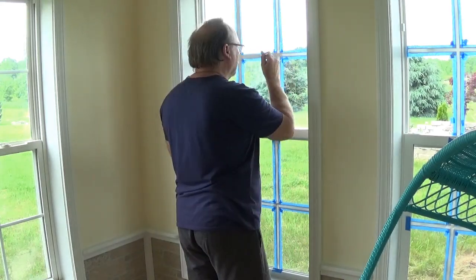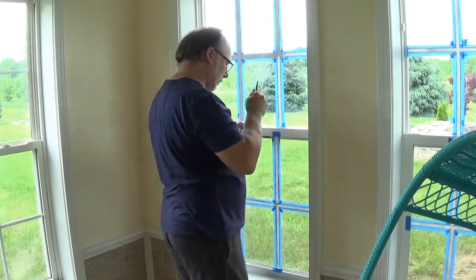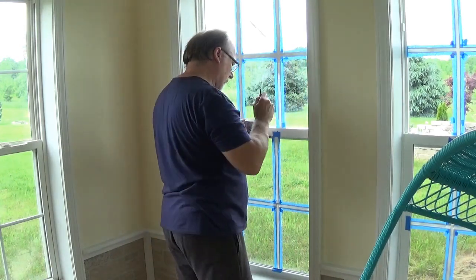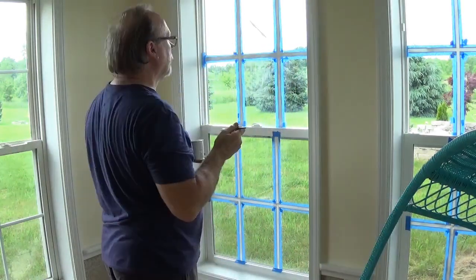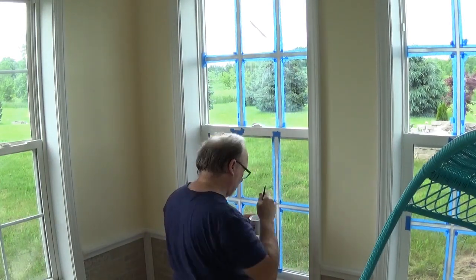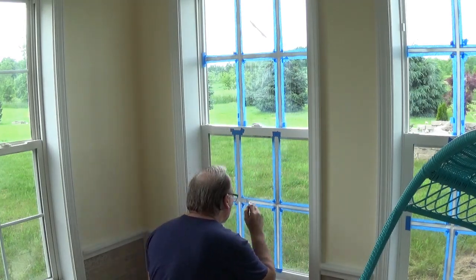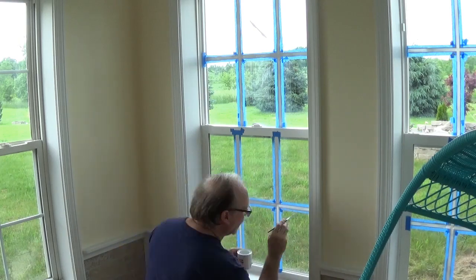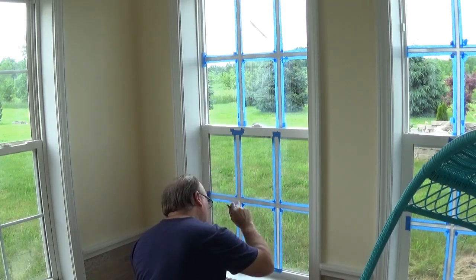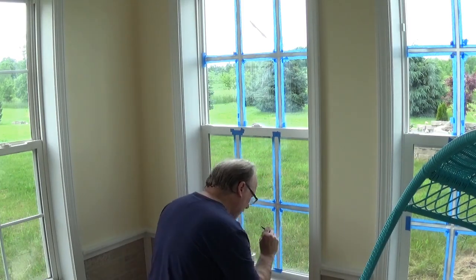It was adequate for this. Now I wouldn't do this in my home. You could very easily dress up your windows like this. You could put all kinds of patterns on it. But this is out of my pole barn in my daughter's art studio, so it's not as critical that it looks as nice. But this turned out really well, and it's a great effect. And if by chance you don't like the result, you can take this off in 5 minutes. You can take all this paint off with a scraper with a razor blade in it. They make a paint remover scraper for that purpose for like $3-4 at any hardware store.